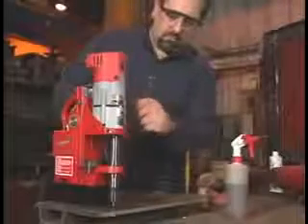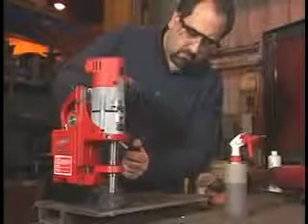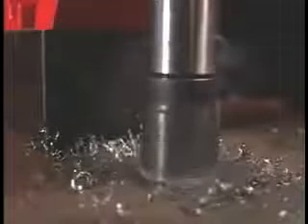Start the motor with the ejector pin and cutter above the work. Proper technique requires some practice — the key is to apply firm, constant pressure. If you're not applying enough force, the chips will be small and broken, which increases drill time. If the motor is laboring, you're applying too much pressure, which slows drilling speed and can damage the cutters.